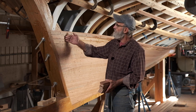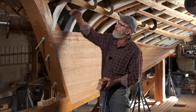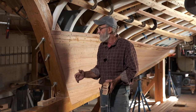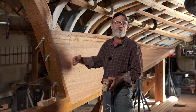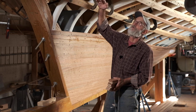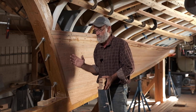The way it showed when you smoothed it up, you lose an awful lot of thickness to the concave-convex business going around the corners. So it was never something I wanted to do again. I wanted to strip plank a hull, and I've always thought of progressive bevel sawing in the strip planking, instead of having this large glue line on the inside when you're going around a futtock curve, or a large glue line on the outside when going around the curvature of the hull.